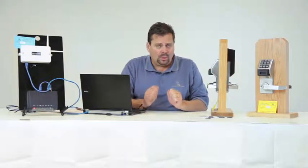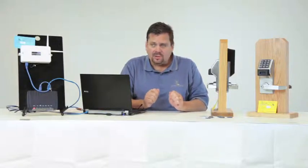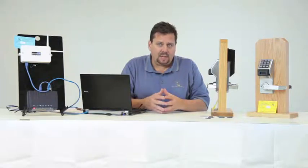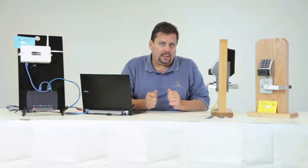What's really important when you install is selecting the correct locations. First of all, you want to select a location for a gateway in some type of secured area, an office, closet, somewhere that is going to be near the ceiling, and somewhere that someone's not going to be able to accidentally unplug it, either the data connection or the power connection.